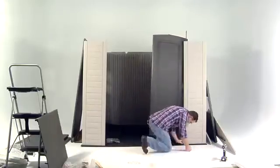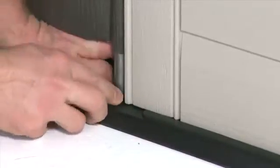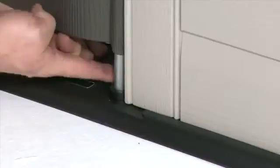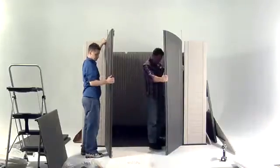To attach the doors, use a cotter pin through each door hinge bushing slot. Just insert and bend back with pliers. Each hole in the front gable slides down over the door hinge tubes, then the entire assembly is secured with screws.